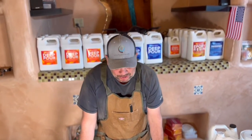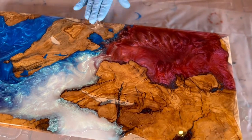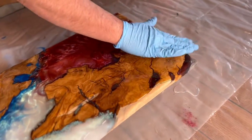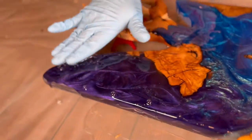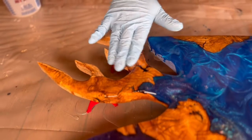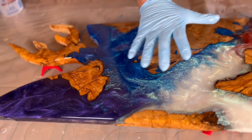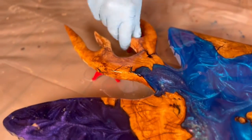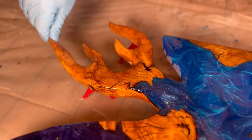How cool is that, folks? Once I have my resin poured on there, I like to chop these edges like this. You can do it with a hand, a paintbrush, a bondo spreader — whatever you have to chop this area. All this does is it makes sure that you spread the epoxy out evenly. You can also use a square notch trowel, or you can cut notches into your bondo spreader. It disseminates the epoxy more evenly. I like to put the majority of it in the middle and then work it out on the outside because the epoxy will self-level eventually. You want it all to be level so that when it cures, it's all on one nice solid plain surface.